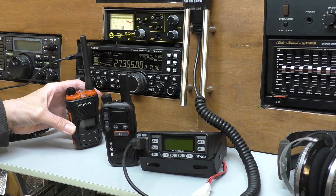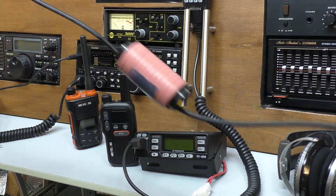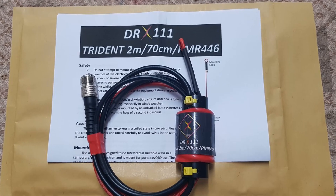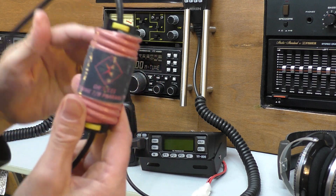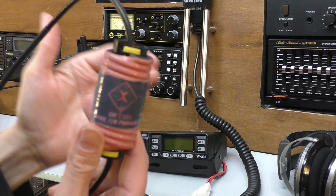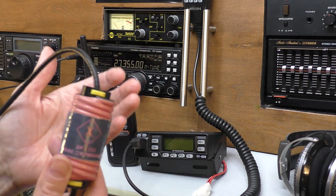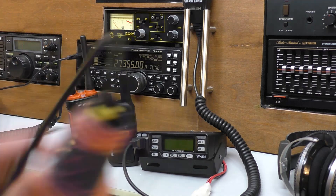In the future — I haven't got time today, and it's absolutely chucking down with rain at the moment — but I will be setting up this wire T2LT-style antenna. This is a 2-metre, 70-centimetre DR-111. So I will be getting out my fibreglass telescopic pole and setting this up in the garden. This will work on the correct band, and I think the audio will be a lot stronger. At the moment, my CB antenna is picking up the carrier signal on the FM really strong, but the audio is suffering because it's just not resonating my 27 megahertz antenna, and I'm transmitting on 446 — so it's not the right antenna.